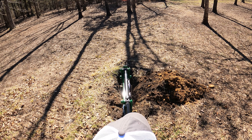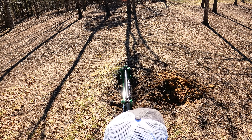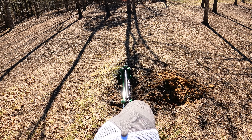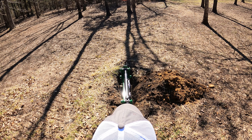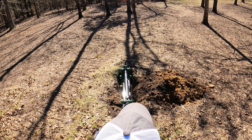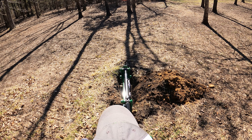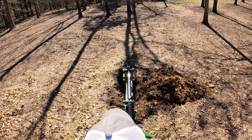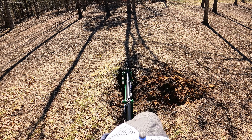The setup here is 1500 RPMs. Based on my flow meter, that's right around wide open throttle. When I did initial readings for this tractor at wide open throttle — 2700 RPMs — I think it was right at six, and at 1500 I think it's six to six and a half gallons per minute. I just want to show that if you want to run it at this speed, it feels about like wide open throttle did before. It sounds different, but this is kind of what I would expect.